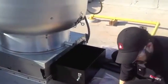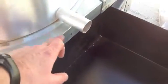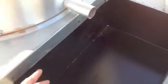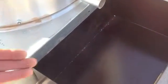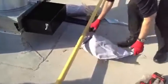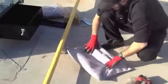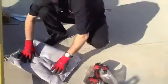I would say this, if you see around the drain spout grease on the deck around here or busted seams where it's peeling out, that's a good place for that deflector shield to go so that it redirects the grease back into the middle of the box. Now when we go for installing the actual pillows, a couple of keys with this rack system. I talked earlier about having them side by side during shipping, not to confuse that.